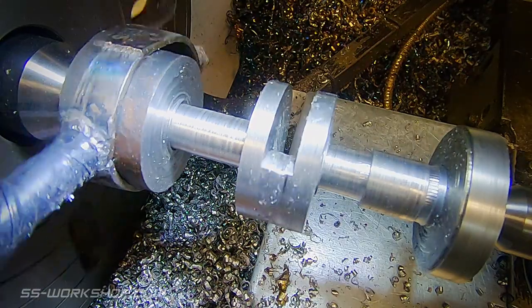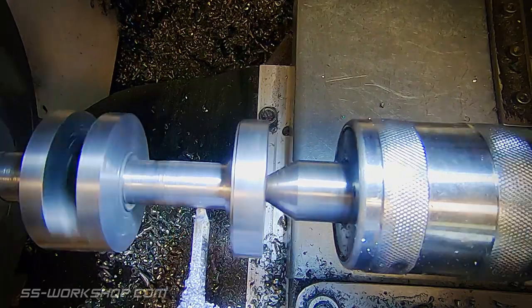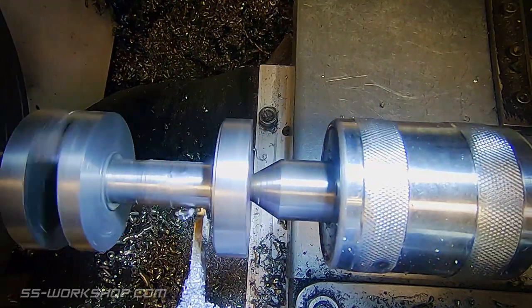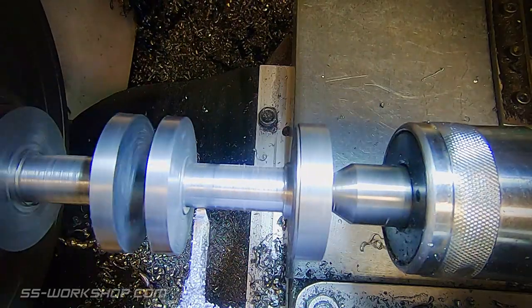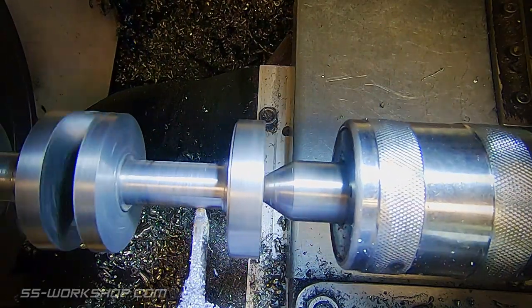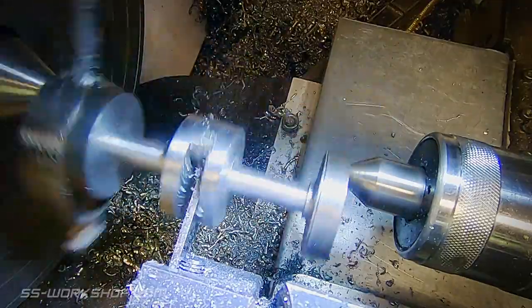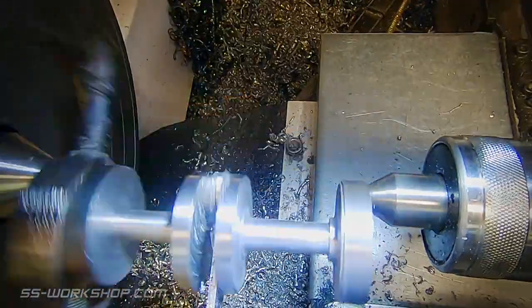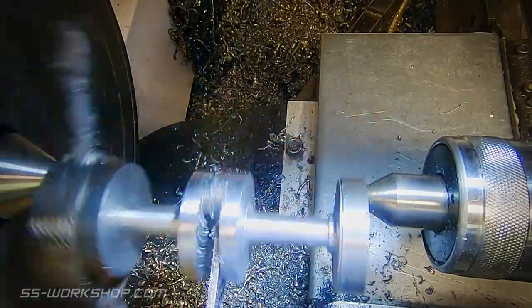At this point you get a really good view of how little material is left in the centre of the crank already. I use the parting tool to finish the shafts, as I find it easier than switching between left and right hand cutters given the depth. It's then time to switch back to the eccentric setup, once again using the offset centre holes. The cutting speed is now sped up, even closer to 200 RPM as I get closer to the final size.